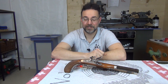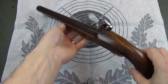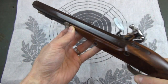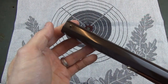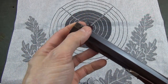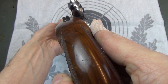So what I propose is we take those features and see what they look like on this pistol and what advantages they bring. Let's start with the most visible, which is the sights. Now this one is actually not adjustable, but as you saw in the period picture, it was quite common to have a dovetailed front sight — which is what I plan to do on this once I've got some practice on the milling machine. I've got enough metal here to mill a little dovetail slot and then make up some front sights of different heights, so I don't need to change out the back sight, although I might change that to a U rather than the V notch.